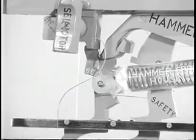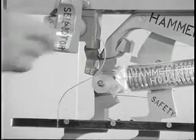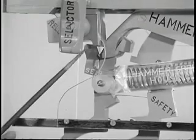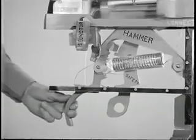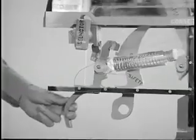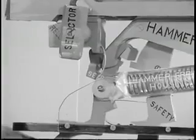When turning the selector to semi-automatic, the movement of the selector rotates the sear release forward on an eccentric shaft approximately 1/8 of an inch, so that it cannot trip the sear. It causes the connector assembly to move far enough forward so there is no contact between the operating rod and the hook of the connector assembly. This positions the sear release so it cannot contact the sear.